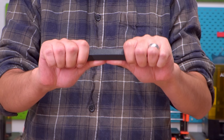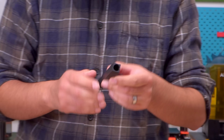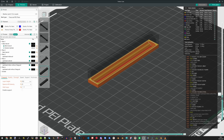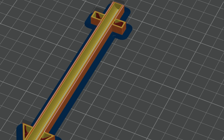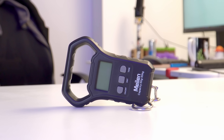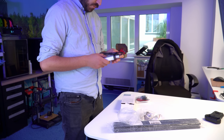Using a method like this can give you an advantage when it comes to strength-to-weight ratio. If you need high flexural strength but also a lightweight part, this could be very useful. With a little optimization, we managed to get about a 10% weight reduction while maintaining a very similar breaking strength. However, simply dumping a negative modifier in a part is neither efficient nor effective, unless you literally have just a straight part. And while we do have an extremely advanced testing apparatus at our disposal, we don't have the best to work with on this any further — so I guess we'll have to get one.